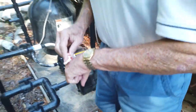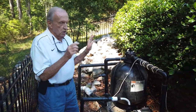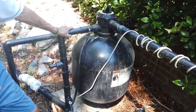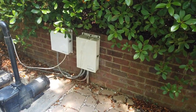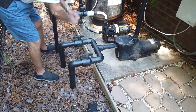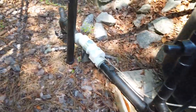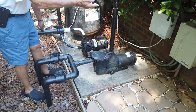To backwash the pool — in the spring you'll have to do it more often because pollen will collect quickly. To backwash, you have to turn the left-hand motor off. Both motors have to be off. Then you have to close all four valves — they turn this way — one, two, three, four.